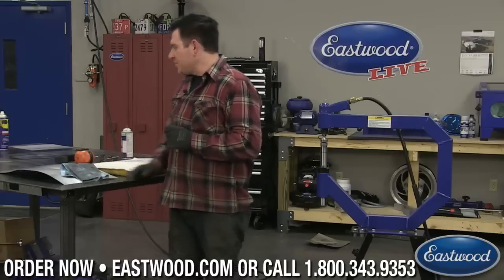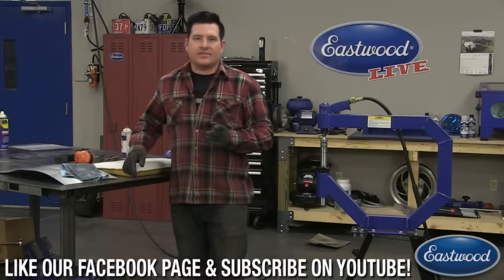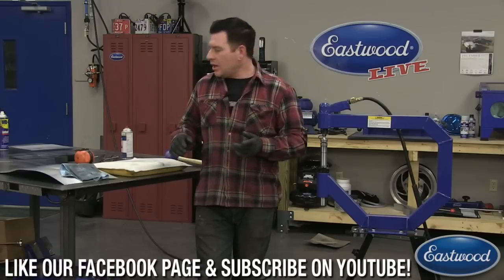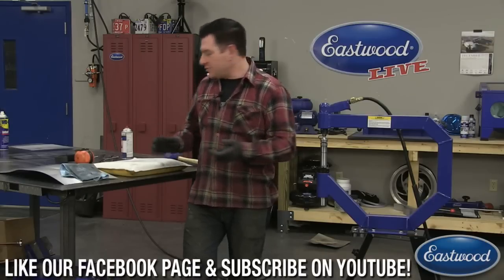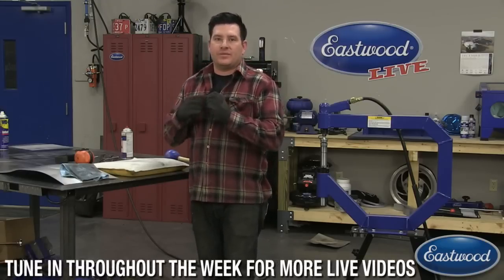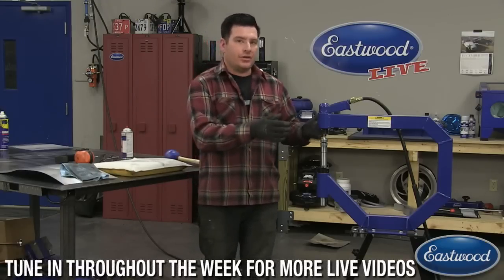Yeah, generally the planishing hammer would be kind of a finish tool for the most part. It's a lot quicker to do like I did in the beginning, where you hit it with the hammer to put the metal where you need it to be, to put the rough stretch in, and then you can work it from there.